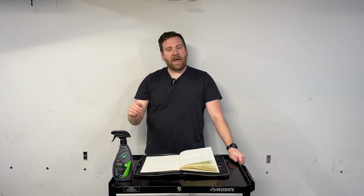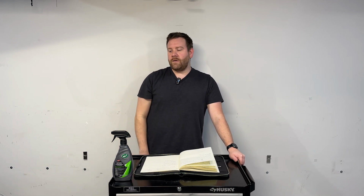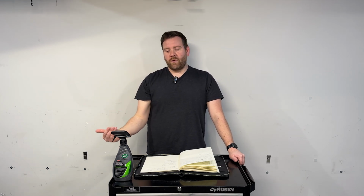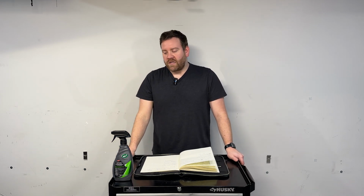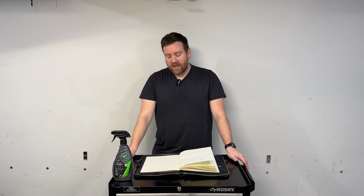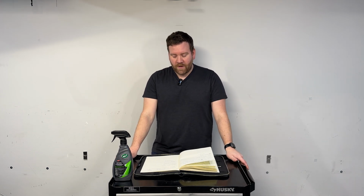This is not that good, but it's not terrible as long as you're working in good conditions. If you throw cold temperatures or other variables at it, it becomes harder to apply, so you've got to try and knock out those variables. That's what I try and do. I always keep it 20 to 20-something degrees room temp when I do my application, because that's the most ideal temperature that you can consistently test at. You don't want to test at 5 degrees Celsius. You're going to be at dew point. You're going to have other issues with application. And I didn't have any.